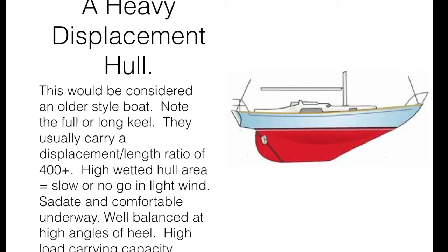The high load-carrying capacity of these heavy displacement hulls will be greatly appreciated by live-aboard sailors, and together with their other attributes will probably make them best suited for those sailors with the ambition to spend much of their time offshore in remote areas of the world. For those of us more inclined to island hopping in the Caribbean or the Mediterranean, or cruising offshore in Europe and the U.S., the sluggish performance of these long keelers may make them less attractive — but that's where you have to make a decision about what kind of hull form you're looking for.